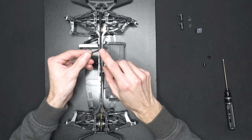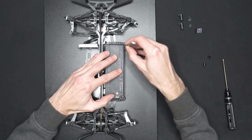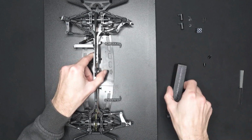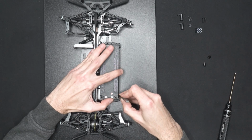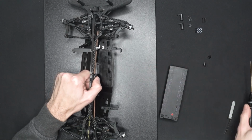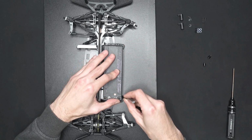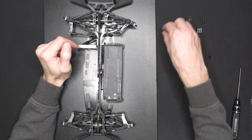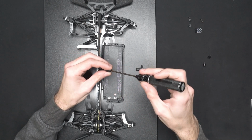A good way to check how much play you have is to use the included feeler gauge set on 0.4, and you want kind of a snug fit. No, that's actually not enough for my taste. Alright, pretty good. And next we're gonna need to find the correct amount of shims to go below the battery holders. Again, to set the vertical play of the battery.